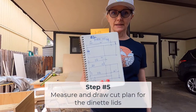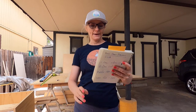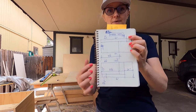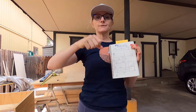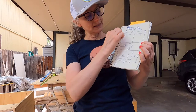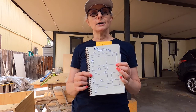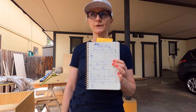I'm going to finish all the tops on the dinette today. Before I do any big cuts I sketch it all up — this is my rough hand sketch with all the dimensions of what I'm cutting. Each side is not exactly the same because of the propane locker that needs to be sealed. So we've got the widths, the length, and then various cuts for the pivot-up flaps. I start with those beginning cuts, then slowly cut down the sections, edge strip them, route out the little groove for the piano hinge, and then fix them.